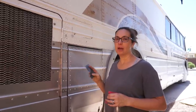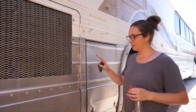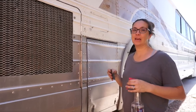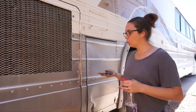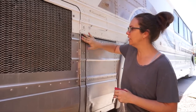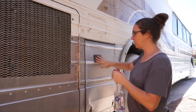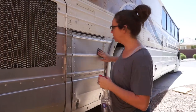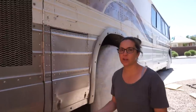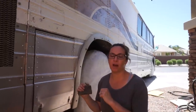It should have a kind of satin sheen when it's all clean. There are some places with gouges and pitting marks that we can't do much about, but we can at least clean it and get it to shine up a bit. We're starting by doing a wet sand with three different sandpapers — starting with 320, then moving to 600, and then 2000 — just with a spray bottle of water, doing it all by hand.